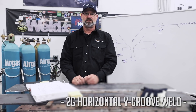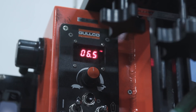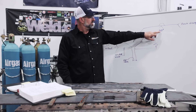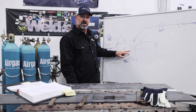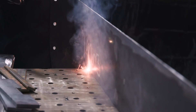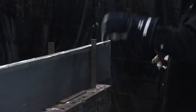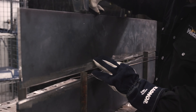Today I'm demonstrating a 2G horizontal V-groove weld utilizing an AWS pre-qualified WPS at D1.1 using the Galko GKR300D. I'm going to show you how I'm prepping my plates. We've got a 30-degree angle on each side, which makes it a 60-degree included angle. You need a 1/8-inch root opening with a root face — I'm going to have a nickel land on it. I'm going to stand these plates up in 2G position and tack flat bars to the front and back, then put the top piece in between. I have a piece of 1/8 wire for my 1/8-inch gap.